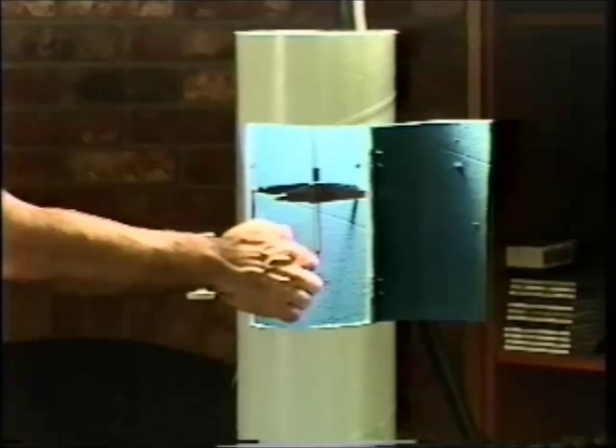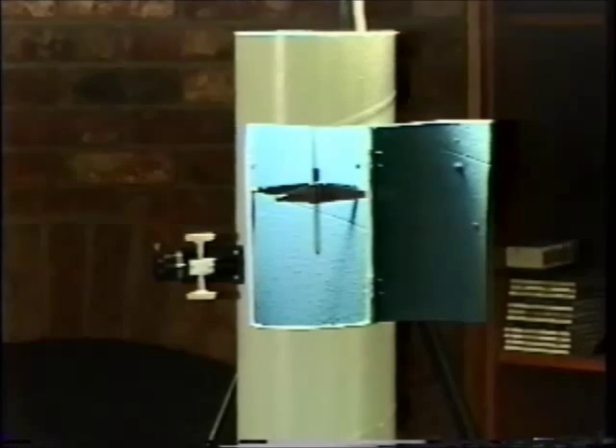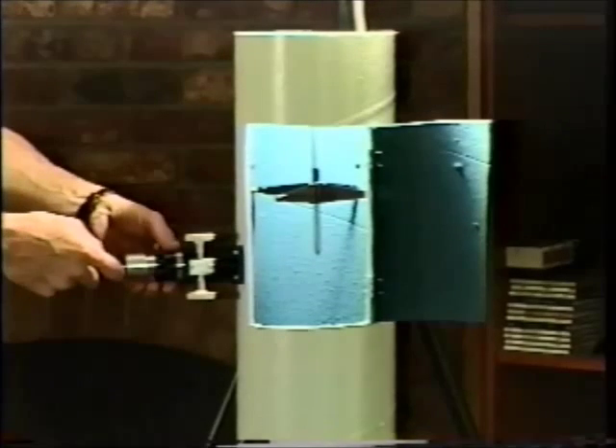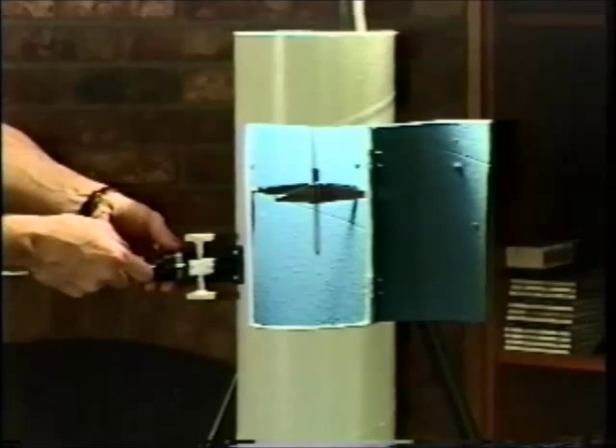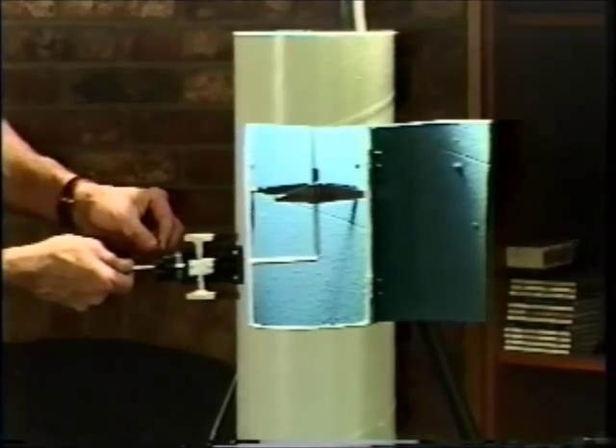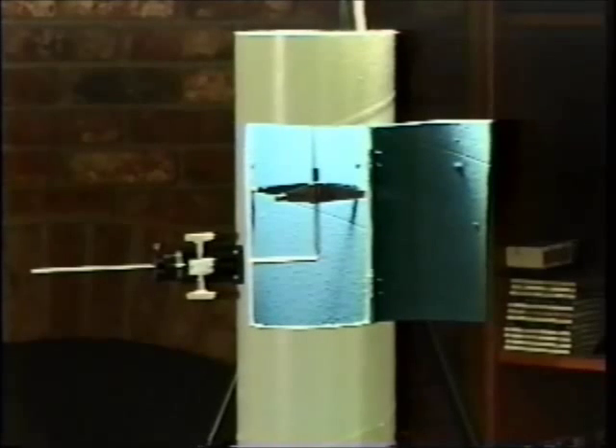The tip of this rod represents the center of the diagonal mirror, and it should fall on the optical axis of the primary mirror. This second rod runs down both the mechanical and optical axis of the focuser. When the focuser is properly squared on to the tube, the optical axis of the primary and the optical axis of the focuser should intersect.